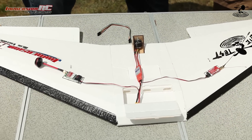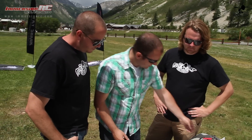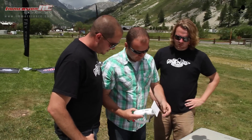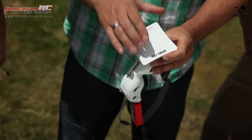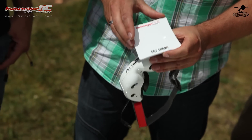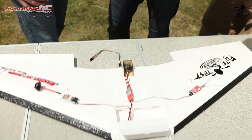What can you fly at distance? Right now you're kind of restricted by video range. If you use a pair of Fatshark goggles — what I have fitted here is our patch antenna, which we co-developed with Fatshark — this will give you at least two to three miles of range. On flat land without mountains you can go further; I have guys flying out five, six, seven miles easy. It's all within the realm of possibility, but it obviously depends on how clean you set this up.